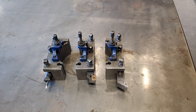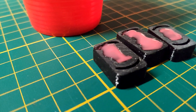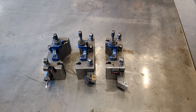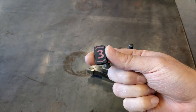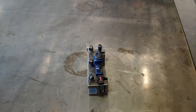Speaking of lathe tooling — imagine you have your DRO and you can set in various tool offsets for each tool. The question is how do you label them? Whatever I tried in the past always seemed to be more of a pain than a relief. So I ended up designing these simple parts which you can just stick on your tooling. I use some silicone molding to fill in the numbers to give them a bit more contrast, and I put one neodymium magnet in the back. I tend to place them wherever the least amount of chips get or where I have the best visibility.